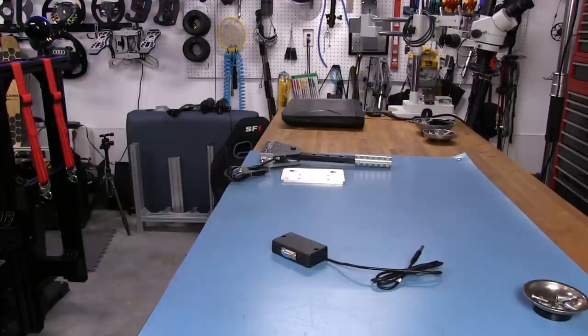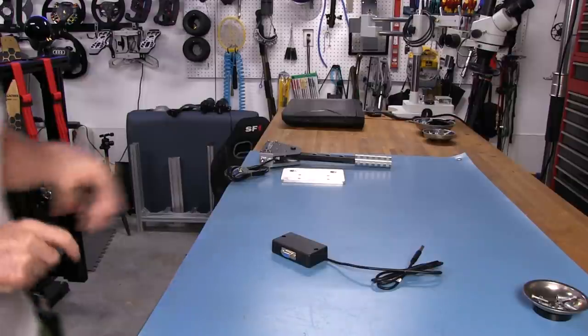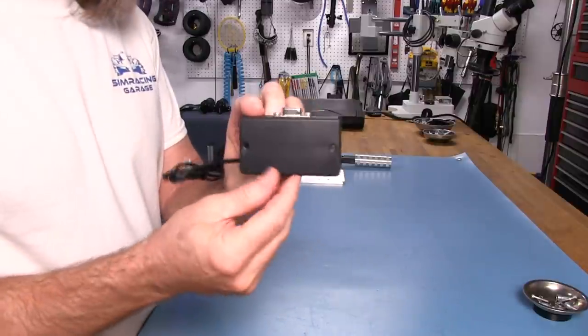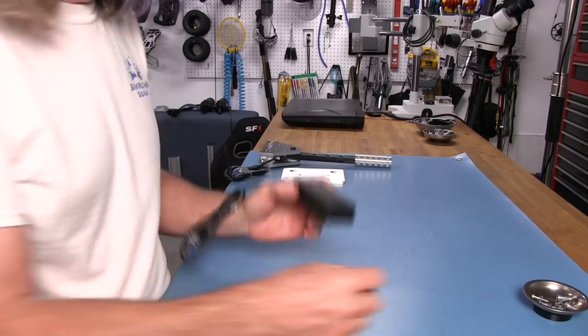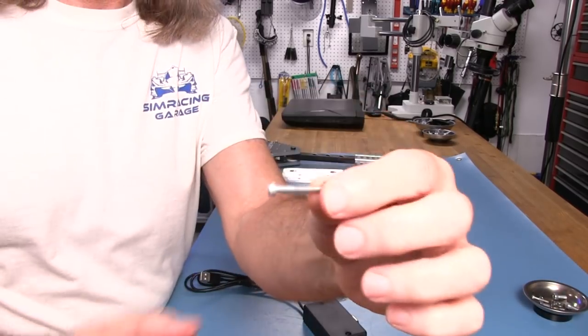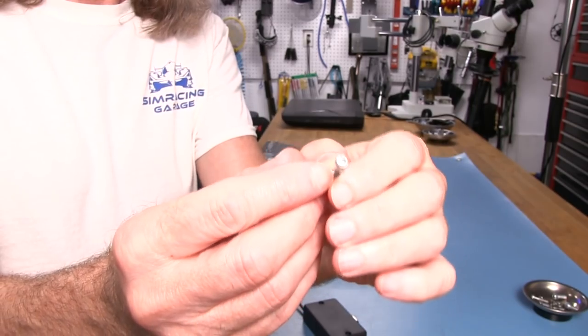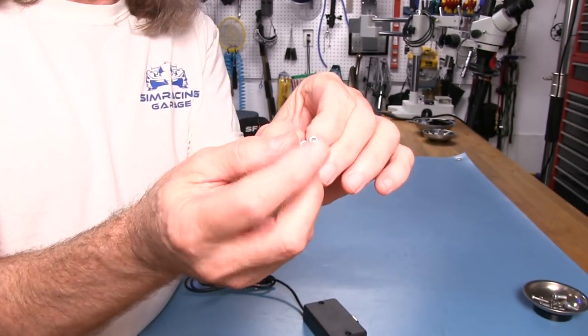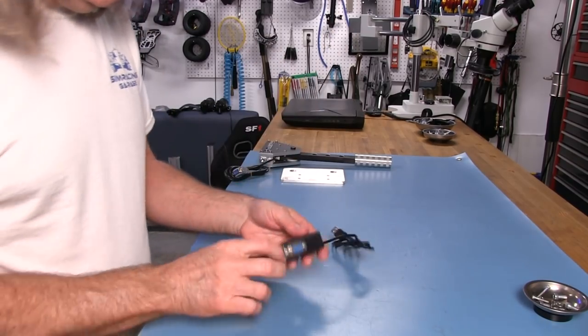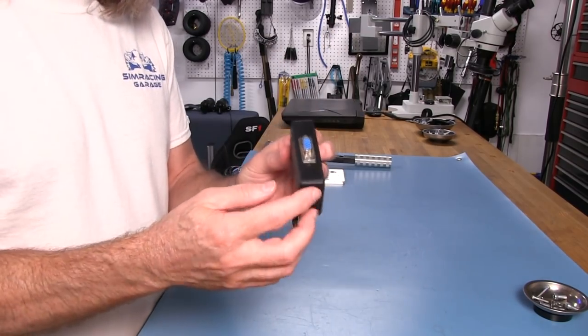Now for our look inside segment on the controller board or USB conversion board. I have the screws already taken out on both sides — they are these little M3 units, socket head cap deals. It's a 2.5mm Allen key in case you ever have to do anything with the controller case. This is an injection molded type case.